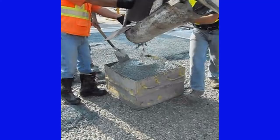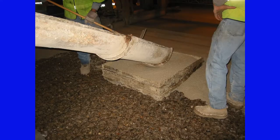The yield box is used to verify that the amount of concrete dispensed does in fact yield what the volumetric mixer says it will. This is typically a 1/4 yard box, 36 inches by 36 inches by 9 inches deep, that is placed directly on a relatively flat part of the deck at the point of dispensing in front of the finishing machine. The 1/4 yard box should be filled and then verify that the reading from the truck does in fact correspond to a 1/4 yard of material dispensed. The concrete placed in the box is acceptable for use in the pour, and the box can just be pulled to allow the tested concrete to be used within the deck overlay placement.